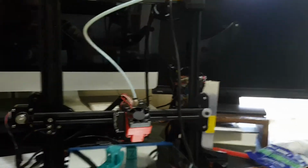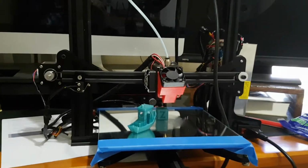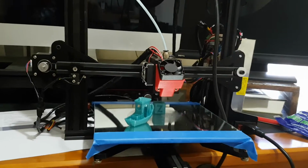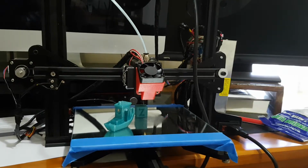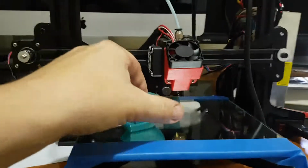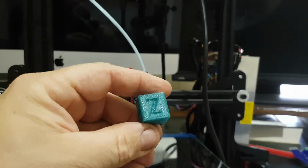What happened was Adam changed things. There are three extruders on this model. You've seen this model used with two extruders, but you can actually have three on it. So what he did was remove one of the extruder drivers and use it on the X-axis drive, and put the other one back in that place, because the original was broken. That's what got him over the mark to get things printed off it. But if you look at this, it's really well presented and well done.